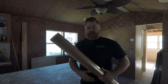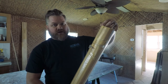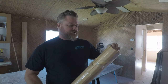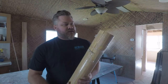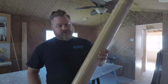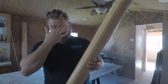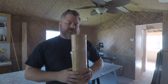For the wainscoting I am using this unfinished tambour paneling, which is just strips of bamboo on a mesh back. I went with the natural because what I really wanted was the coffee mocha colored, but they're out of it all over Florida — three places you can get it and none of them had it. So I'm getting the natural and then I'll just stain it to the color that I want. I'm going to cut it as a roll right through at the thirty-nine and a half inches I need, then get all the plugs and windows cut out, and then we'll stain it.